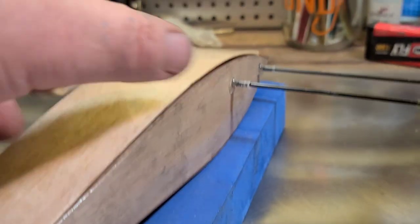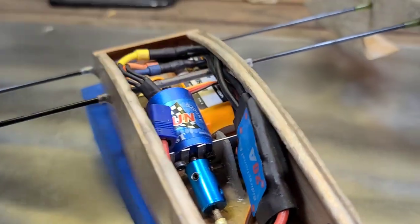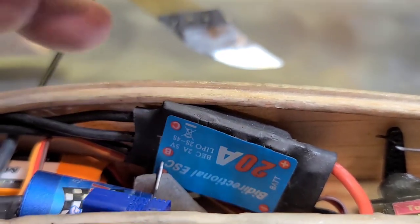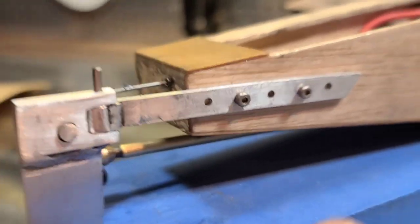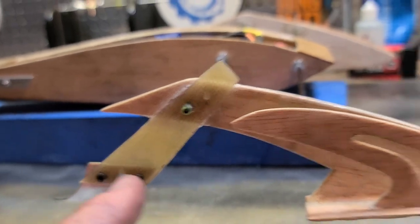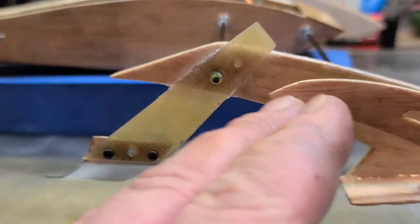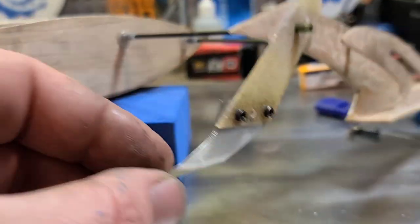Let's start with the tub. I've got an EasyRun 5200KV 2030 motor in the boat, a HobbyWing 20-amp generic bi-directional ESC - 20 amps, 2S to 4S capable - and a micro servo. I made a homemade rudder; it's adjustable forward and back for tunability. I can pull a pin and swap two or three different rudder shapes. This is my turn fin bracket that I made.